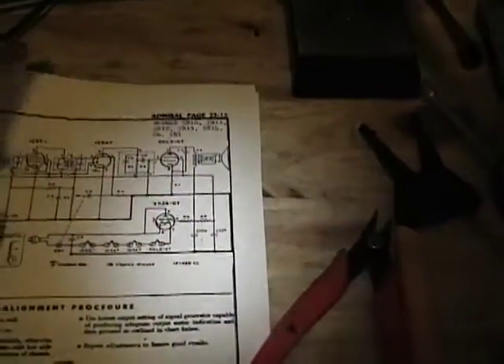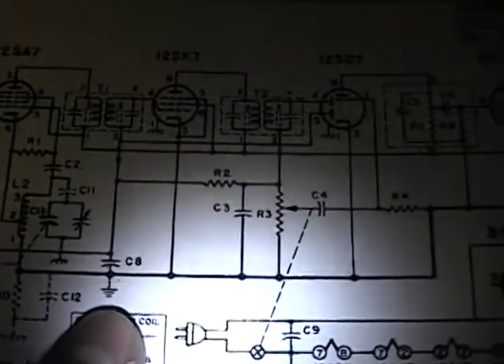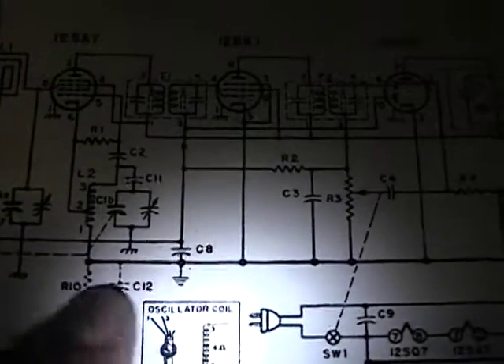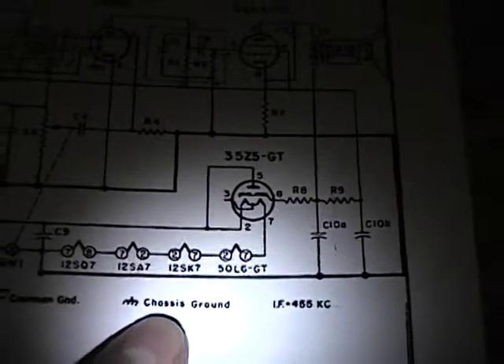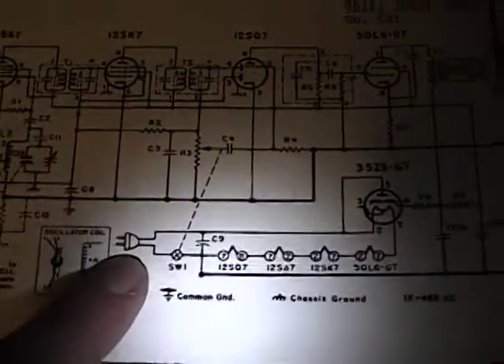In fact, when I look through the paperwork for this radio, there is mention that there was actually a version — this is a 5H11 — there was a 5H11-UL which did have some extra safety features, shown as dashed-in elements here that I don't have on this radio. There are two different symbols: one is horizontal dashed lines and the other has angled lines — those are two different symbols for ground, labeled common ground and chassis ground. If you wanted a UL listing like this Philco radio has, you would keep the metal chassis and the ground — which goes directly to the AC plug — separated.